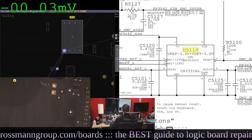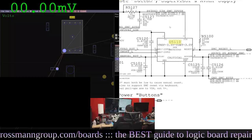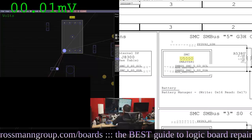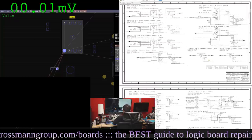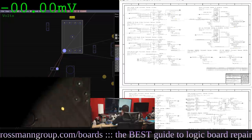There are two reasons SMC Reset L could be pulled down. First, the SMC Reset IC — a tiny 8-pin chip, easy to replace — could be bad. Second, U5000, the SMC itself, could be bad. The SMC has 96 balls and must be taken from a donor board and re-balled, which would be utterly miserable. So I'm going to hope it's U5110, remove it, and see if that does anything.